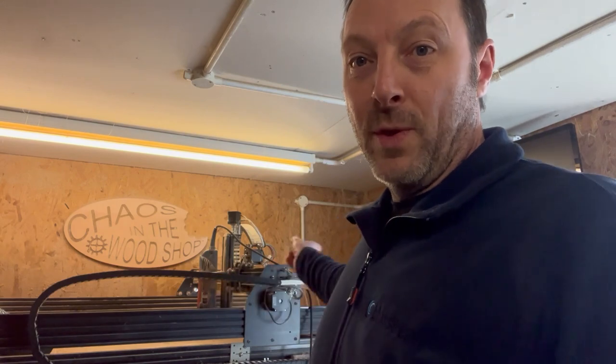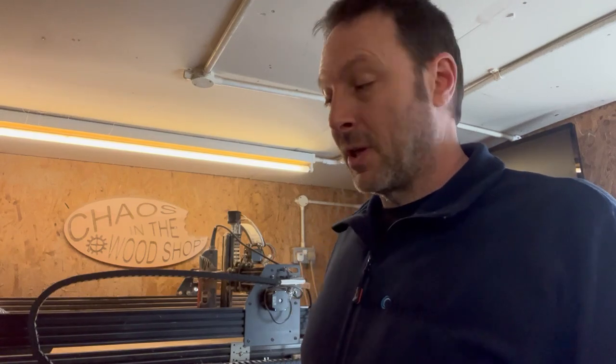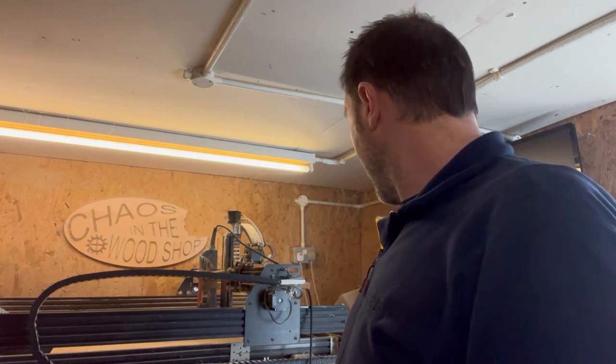After 2 years of using this with the new control, I had to build a new control 2 years ago because the original Chinese all-in-one controller eventually gave up. So I built it out of separates and it kept losing steps. So every time it did a revolution, its center moved further and further away, as you'll see at the end of the video.